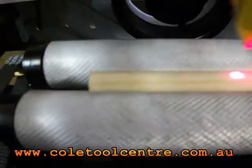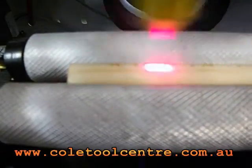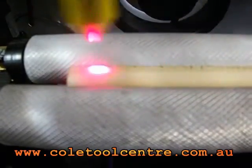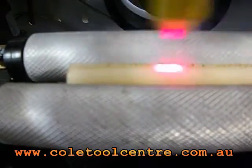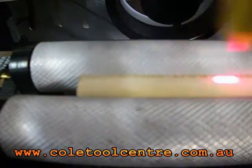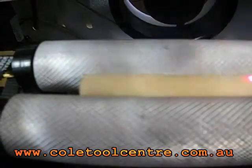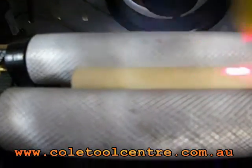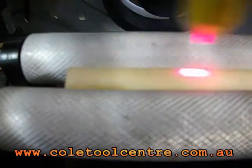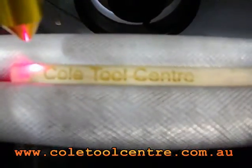This is a smaller piece of dowel and it seems to work very well on engraving. With marking there are a few issues. Just engraving it only goes down one pass at a time and it seems to do that quite well. As you can see, the dowel is very deep — nearly ready to fall through — so it's nice and solidly mounted and getting plenty of surface area to drive on. This one's been done at 20% power, about 250mm per second, and the diameter of the rollers is 28mm. There it is. Beautiful.